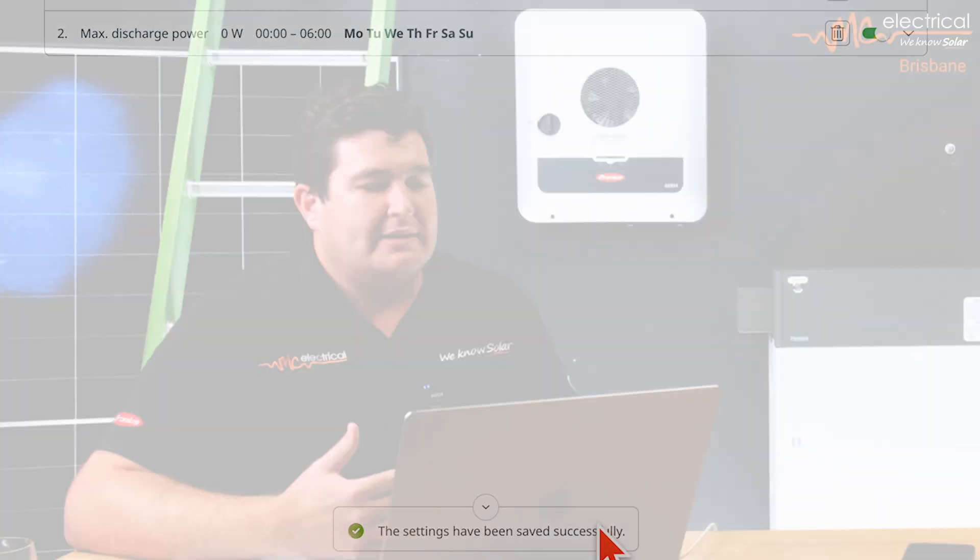It's a very simple and clever way to maximize your battery. Set the zero maximum discharge rate from midnight to 6 a.m., select every day, hit add and save, and now your battery won't discharge when prices are cheap. Fronius took a little while to get all these features in, but it's a pretty nice setup — you can do basically anything you want with your battery: full control over when it charges, when it discharges, and when it runs in self-sufficiency mode. Worth taking a little time to understand your battery for blackouts and free power. Leave some comments below if you have other great tips for your Fronius inverter.